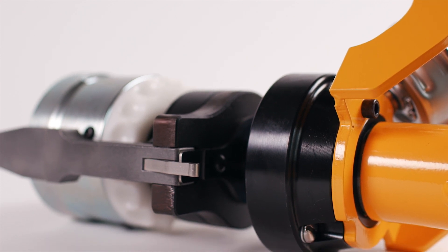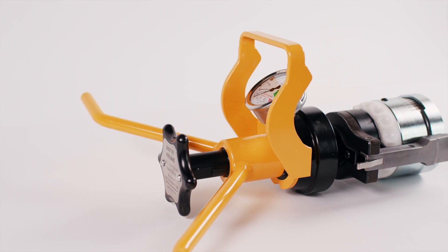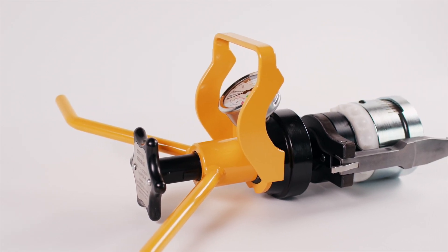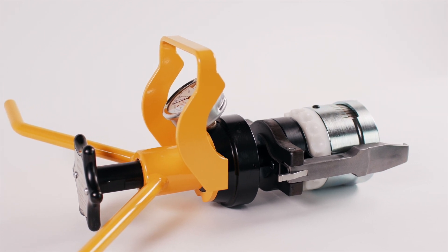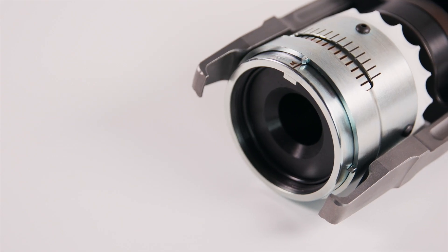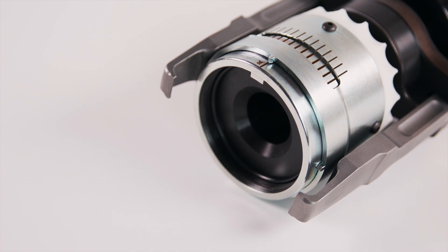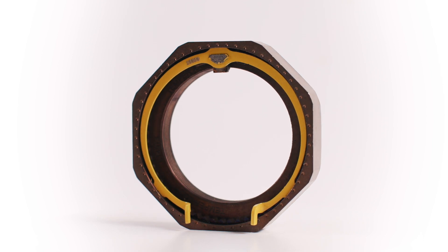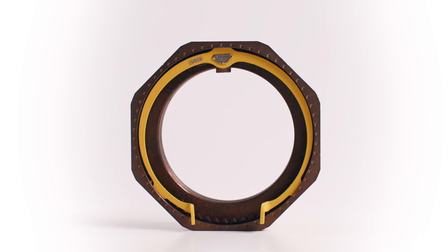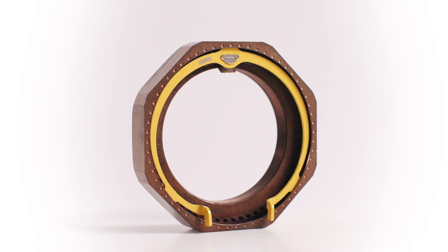The Dr. Preload R-Drive 900 series tool has two special features: the circular key finder and nut turner. Both will come in handy during the bearing adjustment process. There is a key on the key finder designated by the letter R and a hash mark that is used to locate the keyway on the spindle end. The nut turner engages the temper lock nut at the end of the bearing adjustment process and sets the lock nut to hold the bearing setting in place.